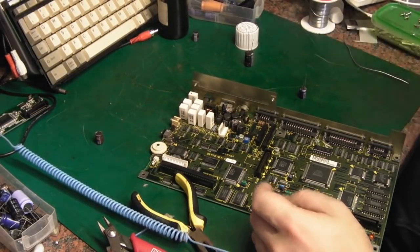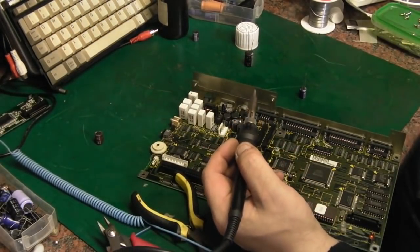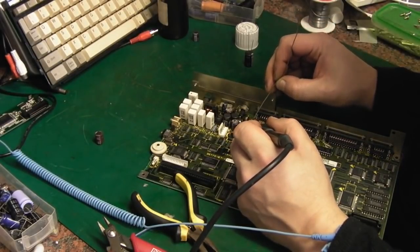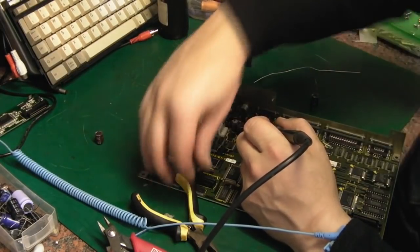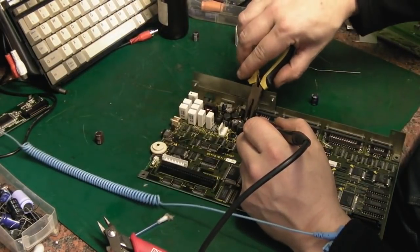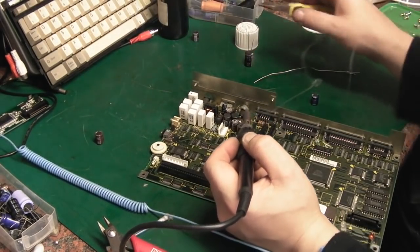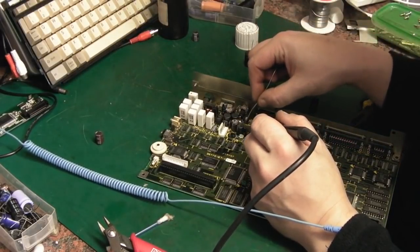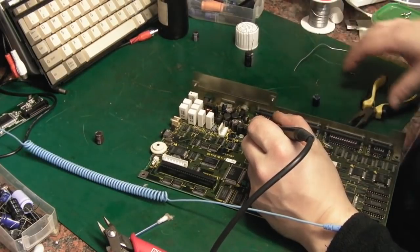For a ten quid laptop — I mean, if I had infinite spare time it'd be feasible to depopulate the entire area, take the capacitors off, and repopulate it. But I just want the computer working so I can play with it. So I'm actually going to go the really cheap nasty route: pull the capacitors off and solder the new capacitors onto the remains I leave on the board. Apologies to the purists, but I want the computer working. I got that one — so at least that one we can put back in the right way.